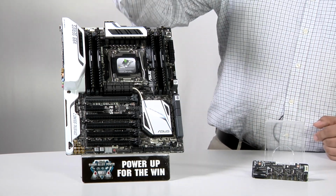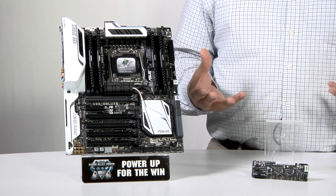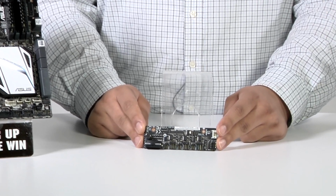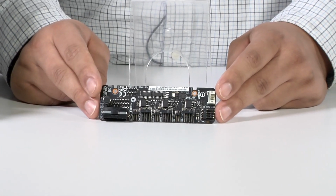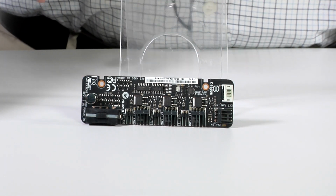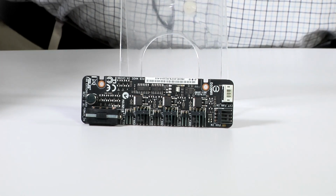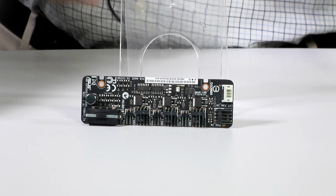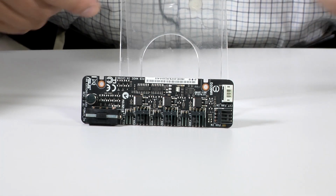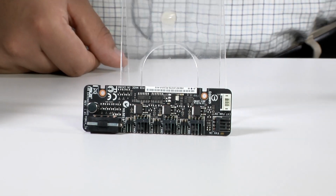So you have everything from the CPU to the motherboard to the PCH to the VRM, but we've gone ahead and even expanded upon it further. What we have for the Deluxe is this specialized fan extension hub module. We've put in a lot of work in here. This is not just a pure passive adapter in terms of just extending additional controls. There's actually logic built on here. So we actually have true additional 3 fan headers on here that would supplement the 6 that are already on the board. That gives you a total of 9 fan headers that are fully configurable, once again, through the operating system or through the UEFI.